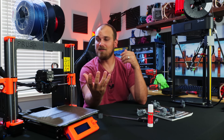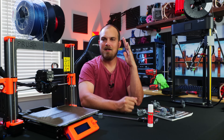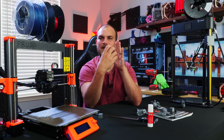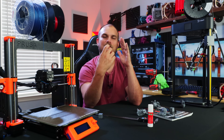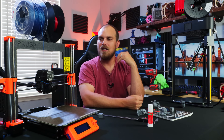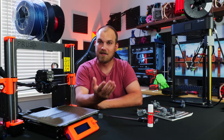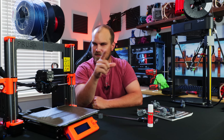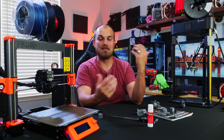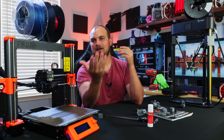When I first saw it during assembly I was like 'this is awesome,' but after using it I was like 'this is not so awesome.' It's so intricate — there's a little arm hinged with a bolt, two magnets on either side that repel each other to reset it, a ball bearing that touches the filament. When filament is pulled out, the ball bearing slides forward, the arm is no longer between the IR sensor, and it says 'no filament.' In theory that works great, but my first experience was not great — I started a print, cut the filament, and after it disappeared into the hot end, something didn't seem right. After a tap on the motor everything shut off.